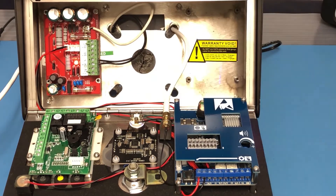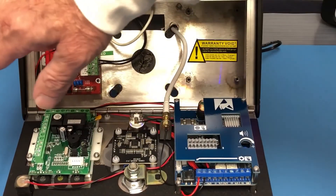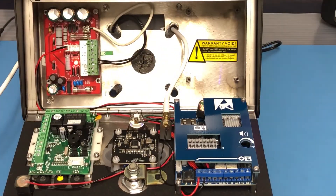I've connected my antenna and unraveled the antenna wire. When you're testing in the office, make sure it's not coiled up — otherwise it'll cause interference. I've already done my site survey and I know that at the client's house I have a 2.4 GHz network with two megs upload speed, so I should not have any problems connecting to the unit.